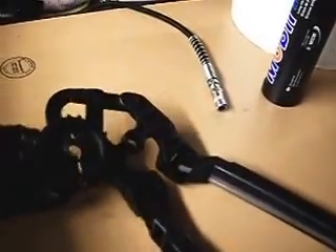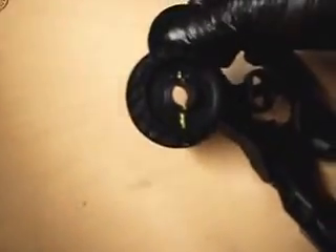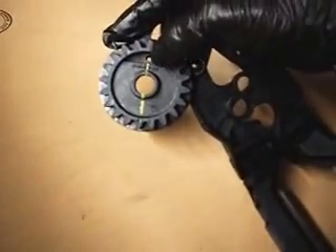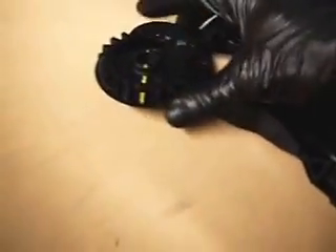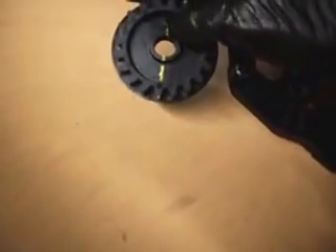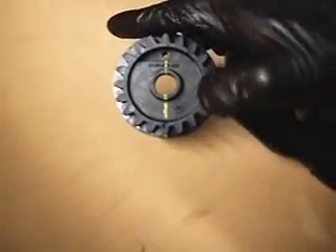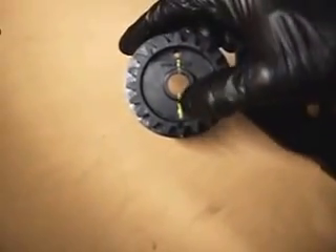On the gear drive wheel of your tong, you'll see there's a hole at the top of that gear wheel that is drilled, and I've drawn a yellow line straight through the center all the way down to the bottom — that points out your critical tooth for timing on your tongs. You can also tell by the little shiny circles on these teeth. Follow that line straight down to the bottom and there's a circle there. There are multiple circles in the pattern, but there's always that one that lines up with the center — that's your reference point.